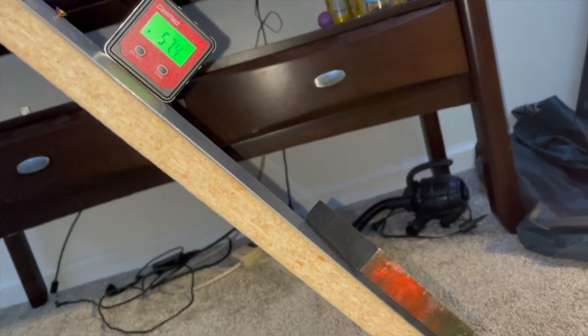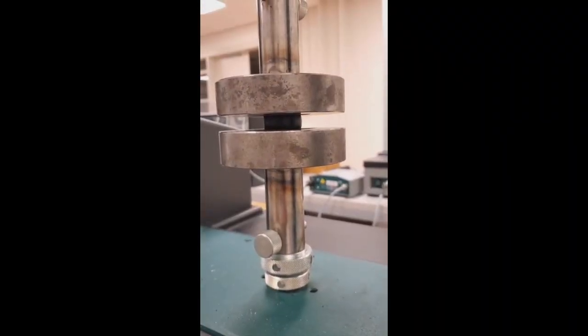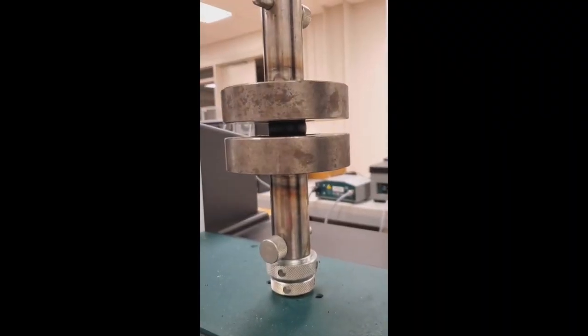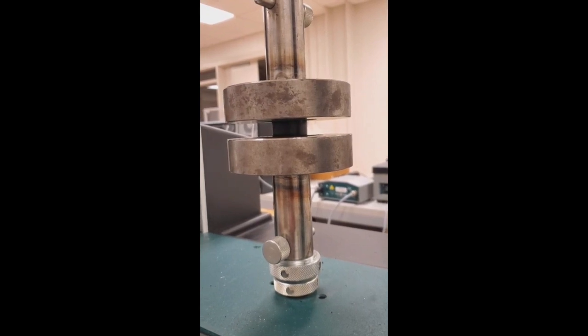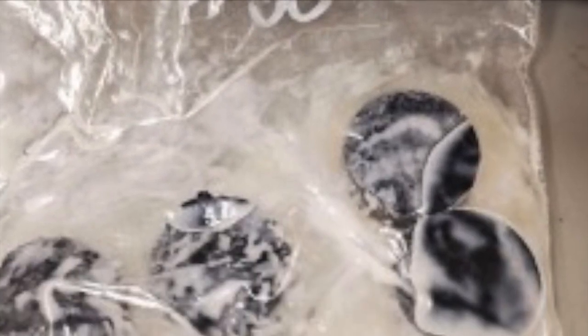Another test was the rubber compatibility test, which involved soaking the rubber pucks in our chosen lubricants and adhesives to make sure these assembly consumables did not vary the rubber's properties in an unpredictable way. The material property tested was compressive modulus at 10% compression. This also gave us an interference pressure for the force calculation.